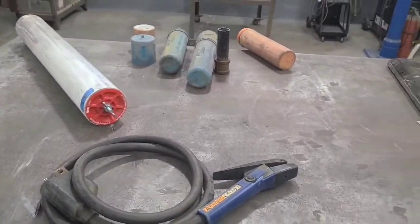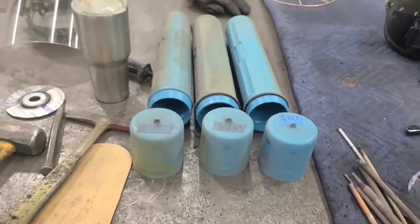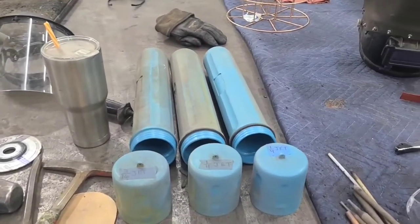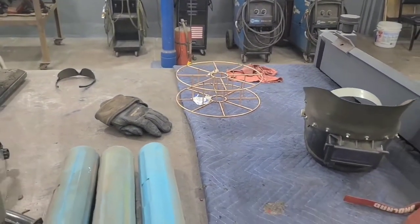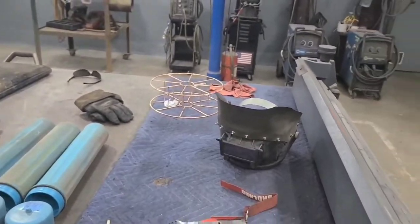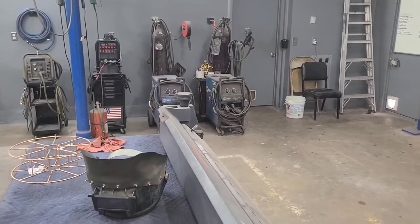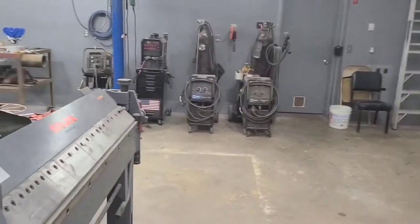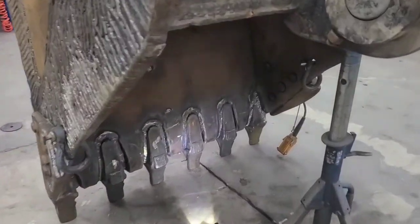Used the carbon arc, carbon rods, the cans that I completely emptied. These, when they're full, are about 14 pound a rod. Went through 42 pound of those electrodes. Used a spool of the ER70S-6 wire. Sometimes first pass with the MIG, with the Miller Matic 252 and the mixed gas. We used to have the 75/25, but I think this is a 16 CO2 and the remainder is argon. I don't know. It's what Airgas calls their gold gas.